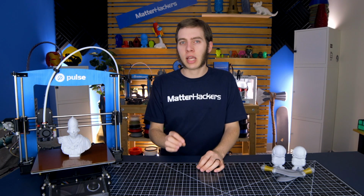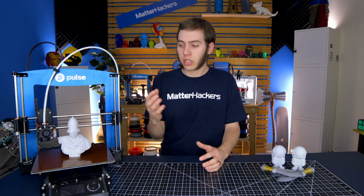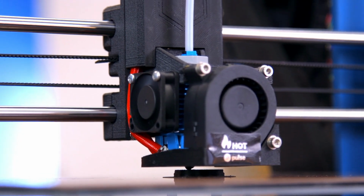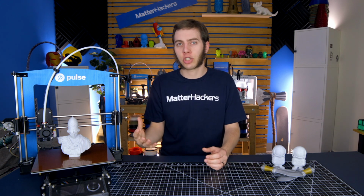One final thing: if even after all this you're still getting layer shifts, you may want to consider adding a Z-lift to your retractions. What this does is when it's done extruding somewhere, the print head will lift up and then move somewhere else, drop down, and continue printing. This can help you get past that issue of there being something in the way of your print.